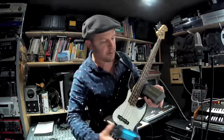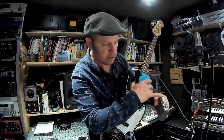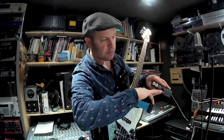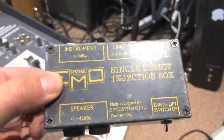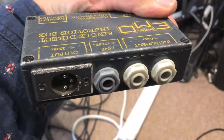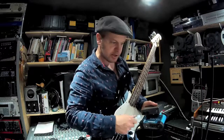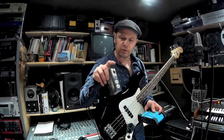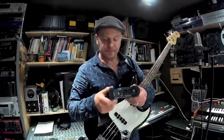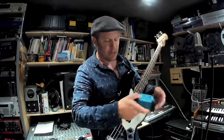There are other models — this is a classic old DI box, similar sort of thing. You plug your bass input here, that goes out to your bass amp, and then your mic signal goes to the mixing desk. It's got a little switch which is the ground lift — up for lifted, down for connected. Then you have speaker inputs — you can take some guitar amps and plug your speaker straight into this, which converts it to a three-pin XLR output.